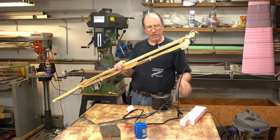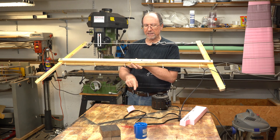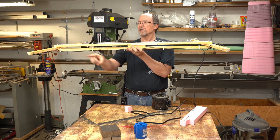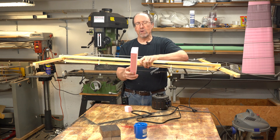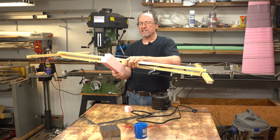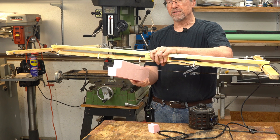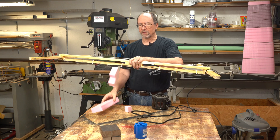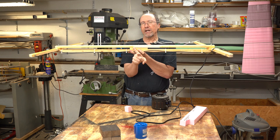On this little amount we did here you probably wouldn't be able to tell. But as you're cutting, because you don't have a whole lot of tension on it, the center of the bow is going to bow back a little bit. So if you're pulling foam down through this way, this bow is going to bow down a little bit — shaped like a curve. Let me do a little demonstration so you can see it. I've got a little less tension on it now so it's liable to bow a little bit more. As I run down through this you'll see it start bowing down. It's not too horrible but there is some bow there. Imagine that through an entire four-foot-wide piece of foam — you'd get a little more gradual bow.